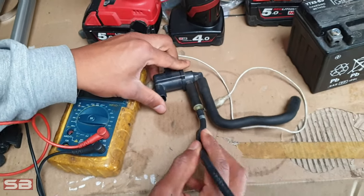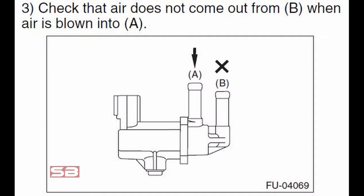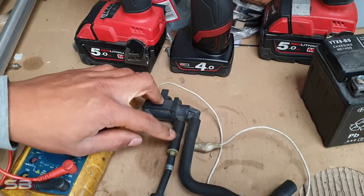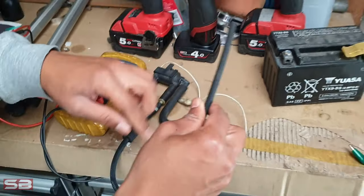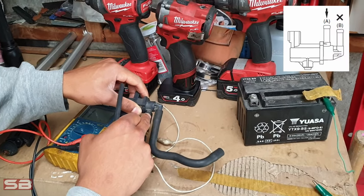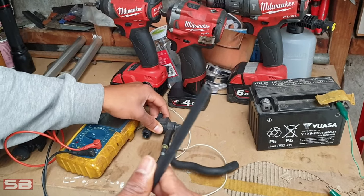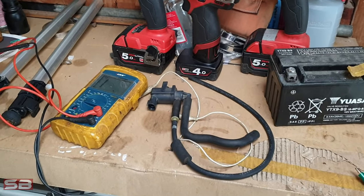The second test — I'll show you the factory diagram now. So this is port A and this is port B. When you supply air through port A in the off condition, there should be nothing leaking out from here. Port B should not be supplying air while there's no power applied.